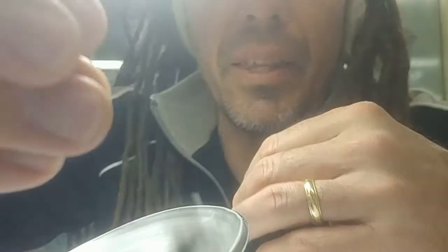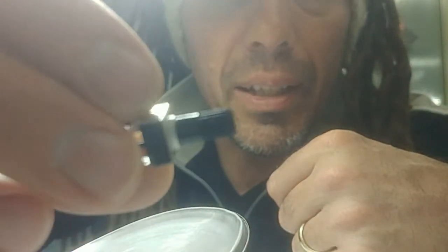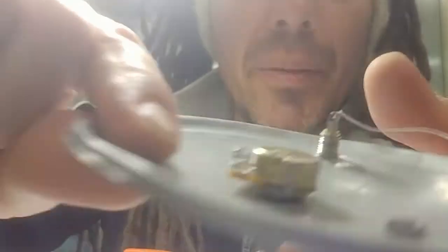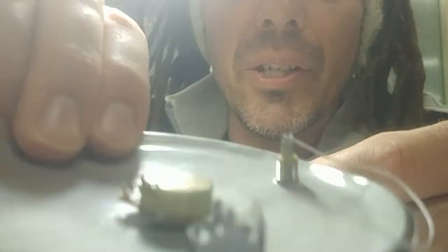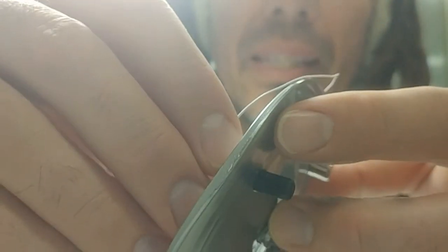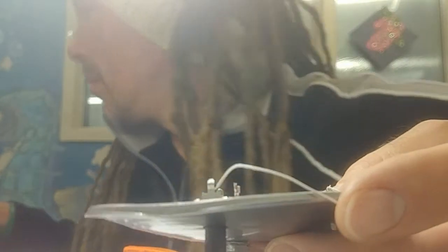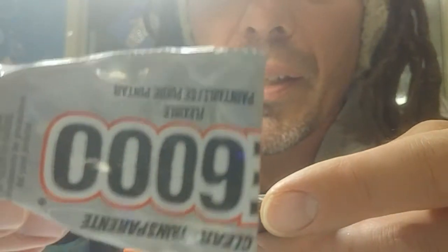If you have a potentiometer like this that you want to attach, this is a little tougher. These potentiometers have a little lip of metal right there, and if you do it really carefully, that lip of metal can form a really nice interference fit. You can press it into place and it's nice and secure. Of course it'll pop out with any stress, but if you can get the hole exactly the right size, you can push it into place and then use some E6000.